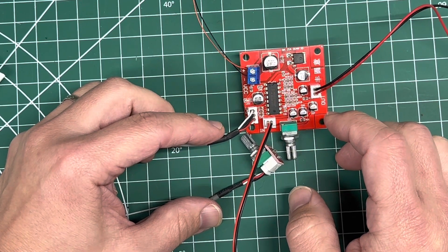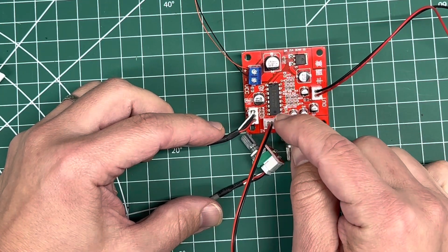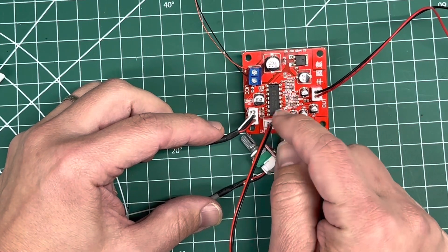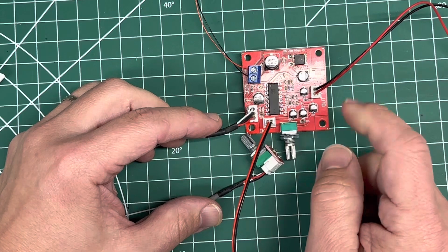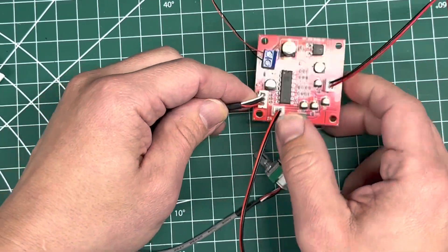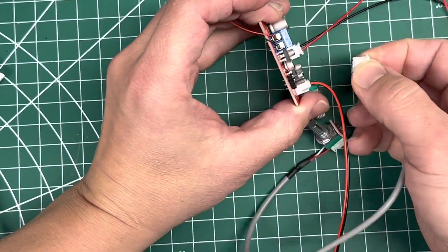It was pretty simple. I set my soldering iron to about 870 degrees, let it stay hot for a bit, put it on top of the R27, pushed and jiggled it around, and it slid right off. Then I just soldered on these three pins here.